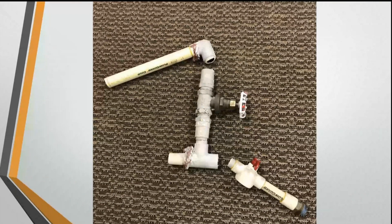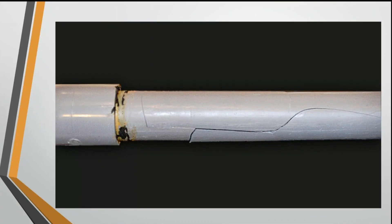This is actually a frozen shutoff from a condo. When this pipe bursts because of freezing, it actually flooded all the condos underneath it. It's all code approved and in the standards — plumbers can use it — I just wouldn't plumb an entire house with the stuff. It's worth noting that this is a different material than what we use on the drain side of the system, which is PVC. That doesn't have a lot of impact resistance either and doesn't hold up well in a freezing situation, but we're talking low-pressure drain lines there. Thanks for watching; we'll see you in the next video.